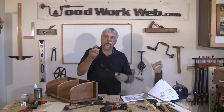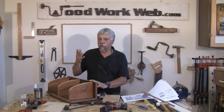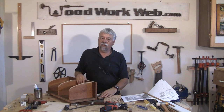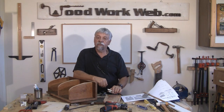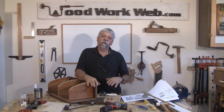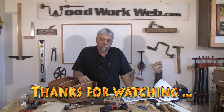So that's our look at magnetic switches today and how they work, along with some of the jigs you can use them on. We looked at the fence on the bandsaw — you can also use that on a drill press or table saw. We looked at using a featherboard on any tool with a steel table. And we looked at another little jig for making thin cuts on the table saw, which is especially good for banding or inlay work with very thin wood. If you need something to help hold your jigs or just need another pair of hands, mag switches might be something for you to look at. I'm Colin Kinnett for Woodwork Web — thanks for watching.